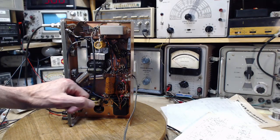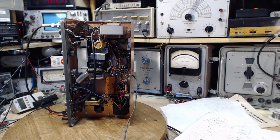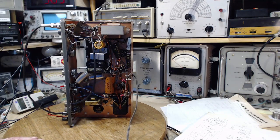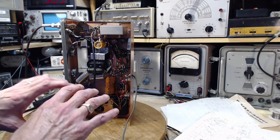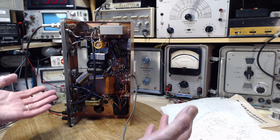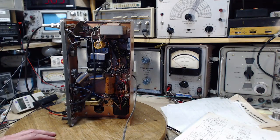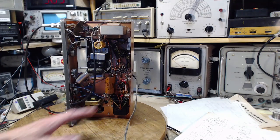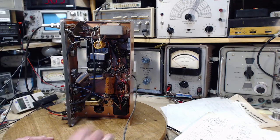How do these currents get in there? Well, I won't go into a detailed discussion because I'd have to do a whole video on this topic, really, to explain it well. But of course, the DC transit system is fed with DC stations. Where do they get the direct current from? They have rectifiers, huge rectifiers. These days, they're huge solid-state rectifiers, rectifying thousands of amps. So the station supplied AC high voltage, transform it down to 600 volts, rectify it. 600 volts DC runs all the streetcars and the subway.